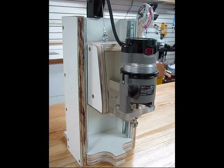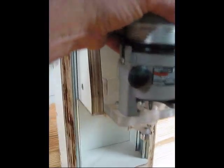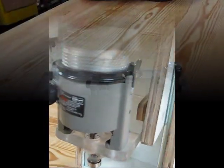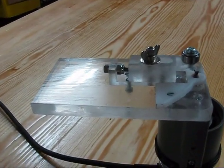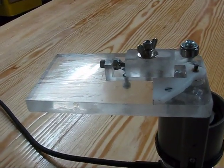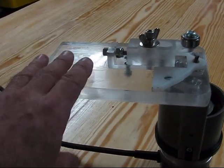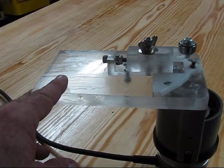The nice feature of the Doolin design is the fact that the router and base is removable — it just slides in and out; it's a pressure fit. What that does is, being able to slide it in and out, you could have several routers already mounted to the base with stops that are preset on your router, router bit, and depth set. If you have constant bindings and purfling lines, all you have to do is pull the base in and out, slap the next one in, and go. It helps out on all the setup time.